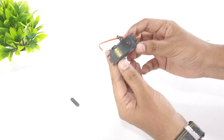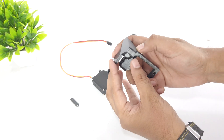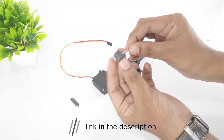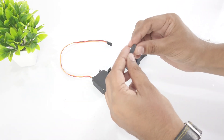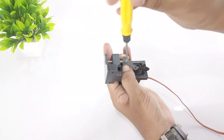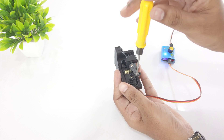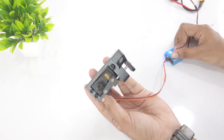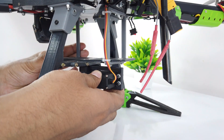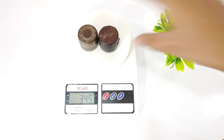I'll be using an MG995 servo to operate the hook. This is the 3D printed mount, printed at 100% infill as I don't want to compromise safety. This is the sliding part attached with a 3mm steel rod. All the file links are in the description. I have also attached an M2 nut to tighten the lever arm. While connecting the lever arm, move the servo to an extreme end to prevent any damage. The aerial hook is working perfectly. I will attach it in the center under the battery plate and connect its wire to the analog pin. I will release payloads weighing around 350g each with a parachute in the autonomous mission.